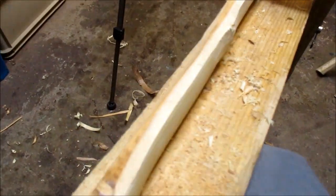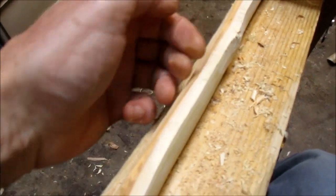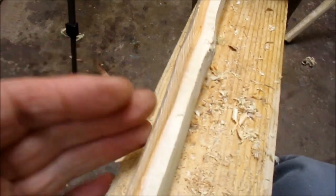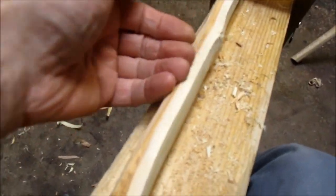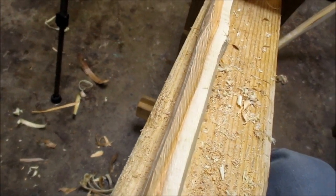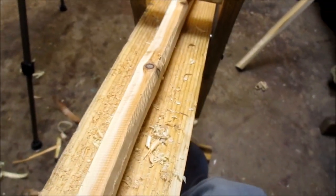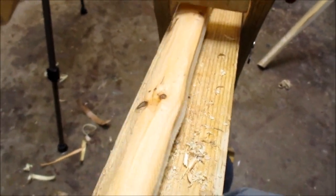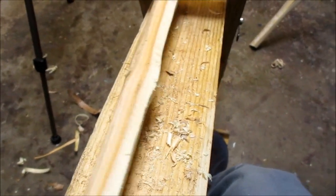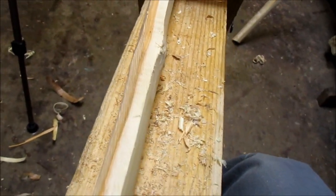Anyhow, we all get problems, we all get mistakes. It's how you deal with them. So if you feel a tear starting, stop quickly and try and remove it, or let it follow nature, follow its course. But it's not always obvious which is the best course of action, which is of course why you move from the drawknife down to more subtle tools as you progress, you know, spokeshave, rasps and so on.